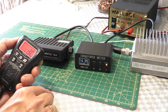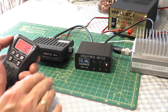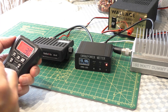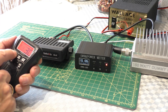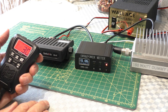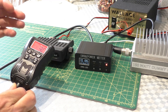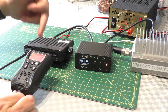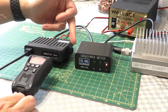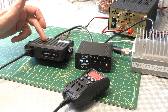Steady 4.2 watts - that's exactly how it ships from the factory. Nothing wrong with that at all; sometimes they go a little under 4 watts but that one is just slightly over. I'll do the same on AM - I have to be quiet because my voice will affect the signal through modulation. AM gives about 4.2 watts again, so that's pretty good. With this mod, according to what I've read, we should be able to adjust it from 4 watts up to 15 watts on FM, and about 8 watts on AM. So let's go inside the radio.